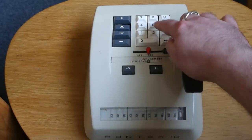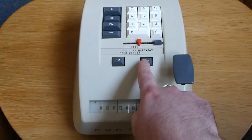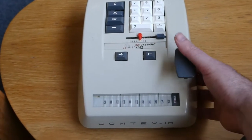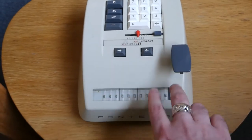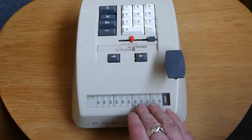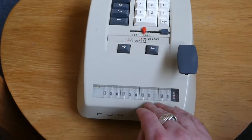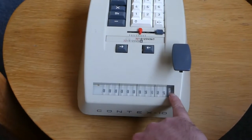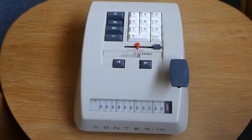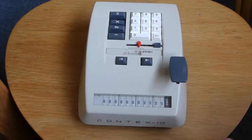To multiply 125 by 25, I can now shift the input to the left and add it twice. By adding it twice, I've added it twice to the next higher columns — to the tens column as it were — so I've multiplied it by 25 now. The counter is now on two because I've pressed this down twice for this digit. So this result here is 25 times 125.